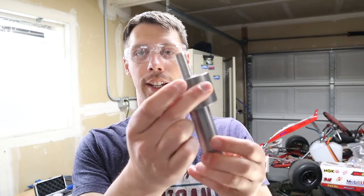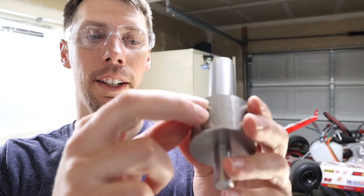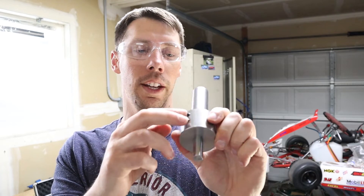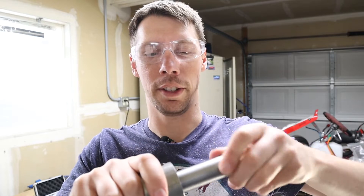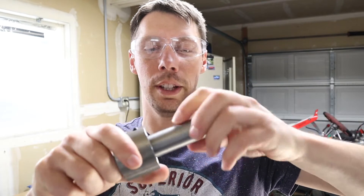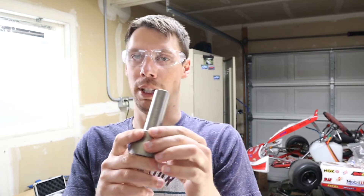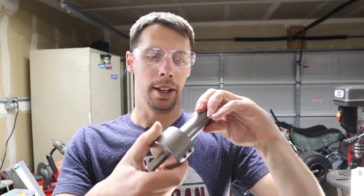She is together — look at that. So I've got these two set screws in the side, and those are meant to engage with those little tiny wimpy keyways — I don't even think they earn the right to be called a keyway — right there in the outer race of the bearing. I noticed if I snugged them way up I'd feel kind of a rough spot, so I loosened them up. At some point I may put some Loctite on there, probably sooner than later, just to make sure that nothing tries to come apart while it's spinning, because that would be bad.